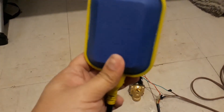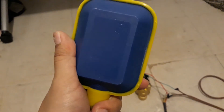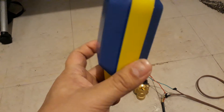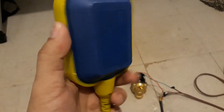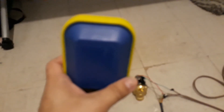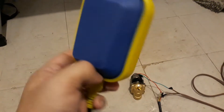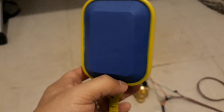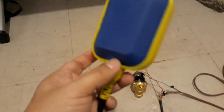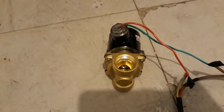What I will do here is insert this float switch inside our water tank, which sometimes we have a problem determining if it is really full or not. The purpose is to allow flow of water when needed and shut down if it's really full, so hopefully we'll be able to save some money filling up this huge tank we have back in our home. To complement that, you need the electric valve.